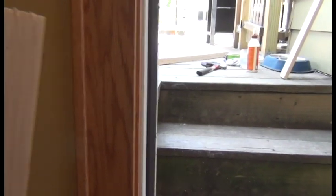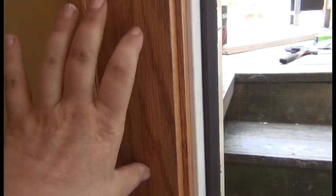Anywhere. Next. So for the side of my door right here, I already have this door frame that I really don't want to remove, and I also don't want to damage it. If I put the hinges directly onto it, probably this little groove would get damaged from the hinge, and then the screws would start moving and it would damage the wood. So instead I'm going to put this one piece of pine wood, and I don't know if you can see it right here, it's just a little bit over, so that gives plenty of space for my hinges.